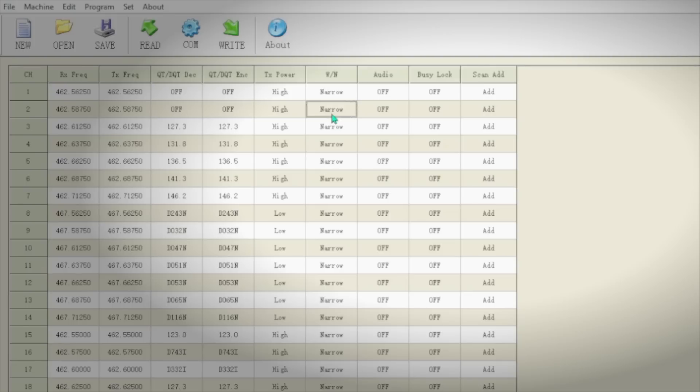You then have to go in and change all of the channels from narrowband to wideband — and there is only one problem: you can't. I was not able to change any of the channels from narrowband to wideband. No matter how many times I clicked, double-clicked, up and down clicked, right-clicked, or left-clicked, the software will not allow it. I thought this was a wideband radio, and maybe it is, but I cannot get any of the channels set to transmit in wideband, effectively making it a narrowband-only radio. Now there may be some way to hack the code plug by opening the .dat file in an XML editor, translating all the Chinese labels into English and changing the hex values — but please, all you computer dorks out there: you don't need to leave a comment telling us how; you don't need to try to impress us.